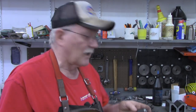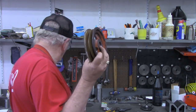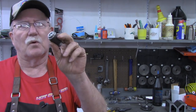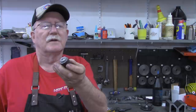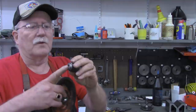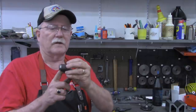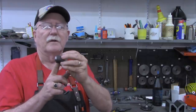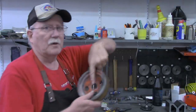Got a piece of scrap here I'm going to use - this is all being made out of scrap by the way. This measures 1.124 inches. The hole in the pulley measures 1.13, so basically all I've got to do is sand it just a little bit in the lathe, then face off the end, drill it for the five millimeter, and cut it to length. So let's turn to the lathe now and get started on what will be the center plug for the pulley.